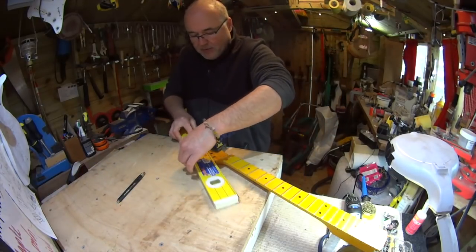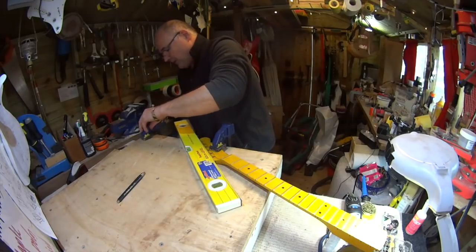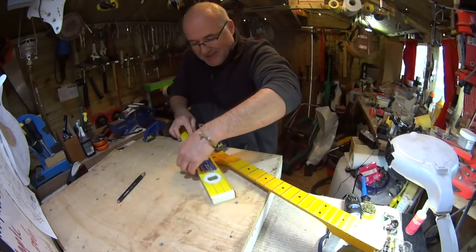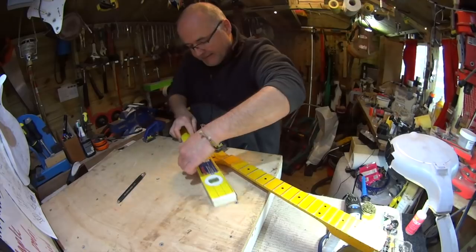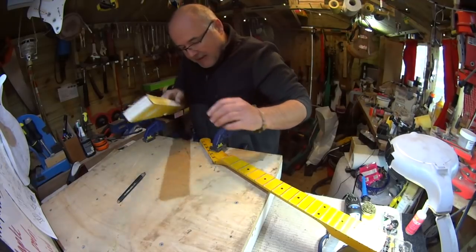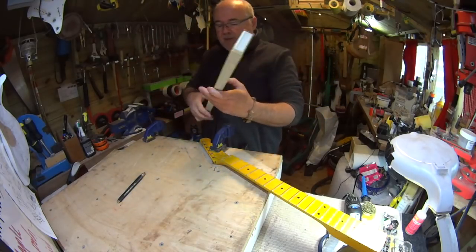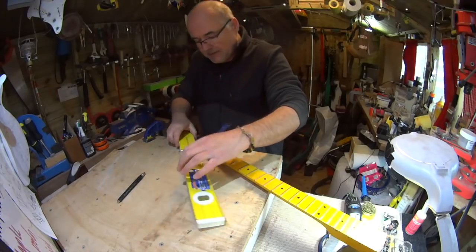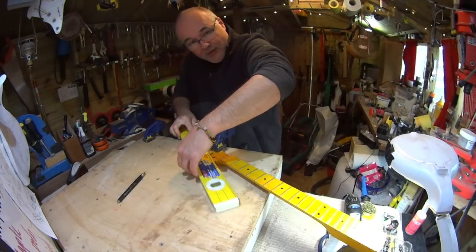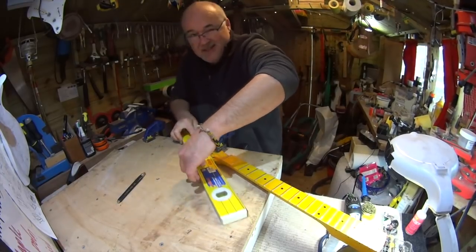As I say, if I was to lock this in place with some clamps, I'm not sure I'll fit here, but let's clamp that into place. I've got a bit more force I can put into it now because nothing's going to move, hopefully. You can hear it cutting nicely, and you can feel the pencil coming off, and it's getting down to take away that last bit. You can knock off some of it and change the paper if you need to. This is ordinary sandpaper bought from my friend Paul at the Tavistock market, but I put double-sided sticky tape on it to make it function as self-adhesive, and it works really well.